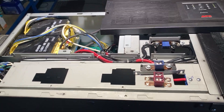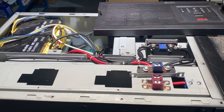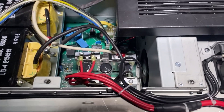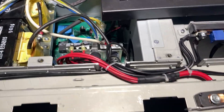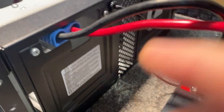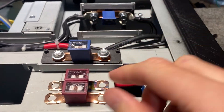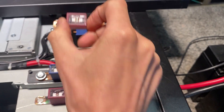Normally the UPS has a cell in here and three cells here in a parallel series pair of strings that go to the heatsinks and the mainboard. We've cut those out and spliced to a simple 120 amp Anderson plug, replacing the original — because this is a 120 amp plug, normally it has 140 amp fuses in.